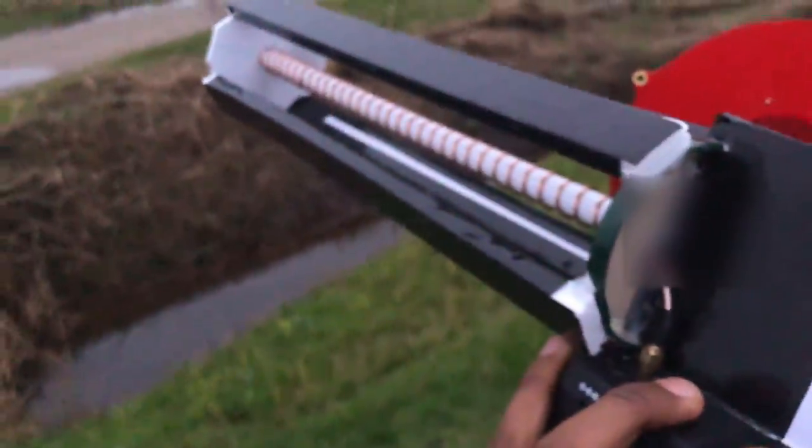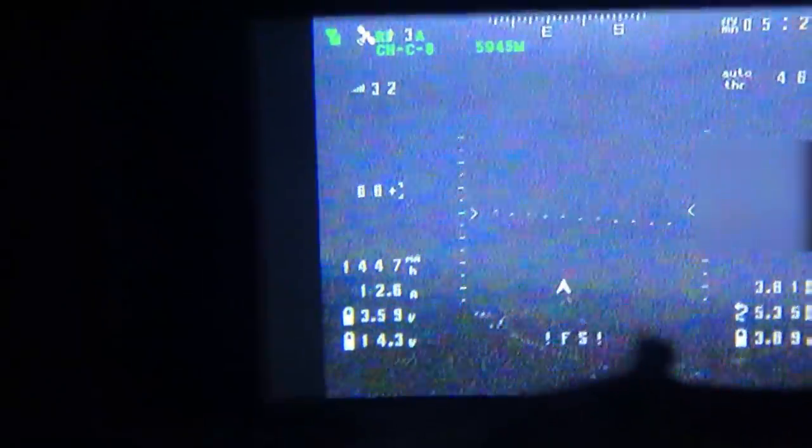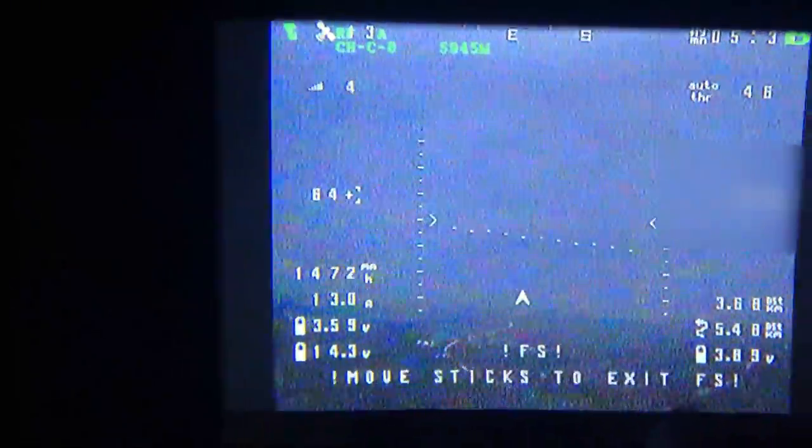Now switching to the helical antenna for comparison — it's turning around on its third waypoint heading back. Aiming it correctly, the video is a little fuzzy, but this is the best I can get at 200 milliwatts at about 3.5 kilometers. I'm going to drop down to 25 milliwatts and repeat the waypoint mission with different batteries to push the comparison further.